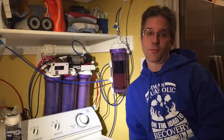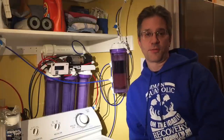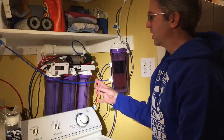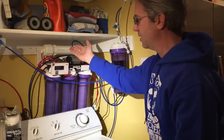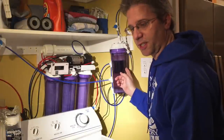This week's video is going to explain how I make drinking water as well as water for my reef using this five-stage 150-gallon-a-day RO/DI system. It's a very standard one — the one I sell on my website — and it uses sediment, two carbons, a booster pump, goes through the membrane and then through a bunch of tubing that goes different directions, and of course the DI stage.